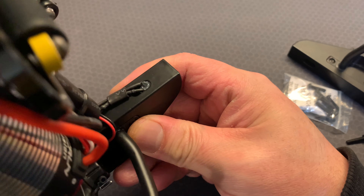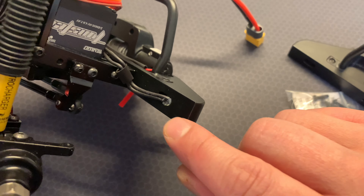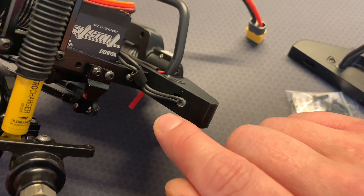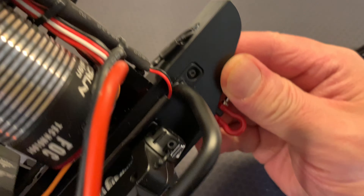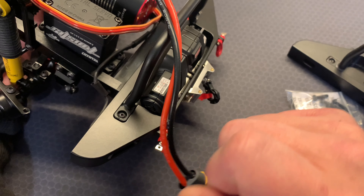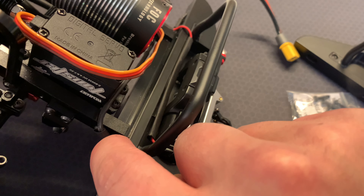For the lights, it was very simple — I installed some 3mm LEDs. This is the 3mm LED on this side, and this is the 3mm LED on this side. At first I was going to epoxy them in place, but decided against that, as if I ever need to service or replace the LEDs I'd never be able to get them out. So instead I used a very tough hot glue, just enough to secure the LED in place. Each LED is wired in parallel with a resistor off a 6-volt regulated power supply coming off the light control unit, all mounted neatly in my receiver box.